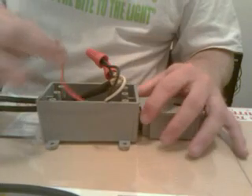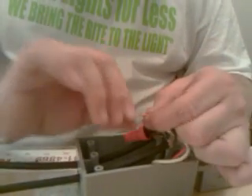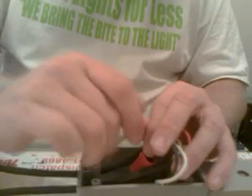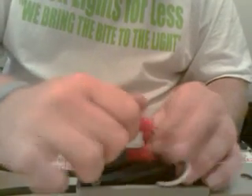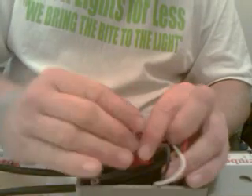Now you have a red wire coming out of your photocell switch — that is going to go to the black wire of your light. Trace the light's wire, wrap them together, and thread on a wire nut. If it doesn't hold, bend the end of the wire just a little bit so the nut has enough to grab, or use a smaller wire nut if you prefer.